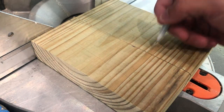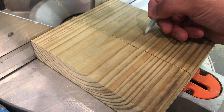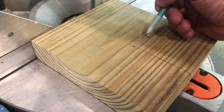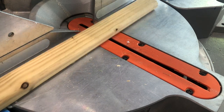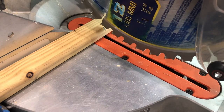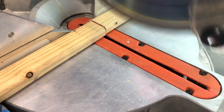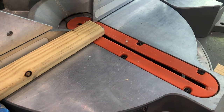If you're advanced and want to start making accurate cuts fast, you just need to learn exactly where to make the mark on your size of board — or how far out from the fence. If you're doing a small furring piece, you just mark the leading edge. Then when you bring your saw down to it, it's right on the money — a quick, fast, and accurate cut.